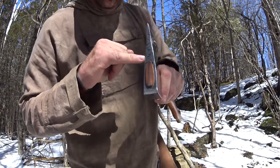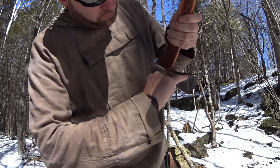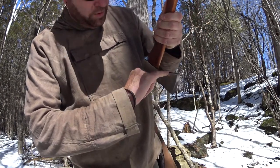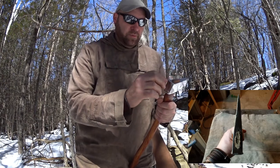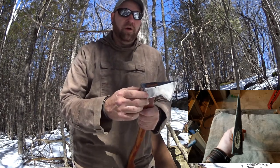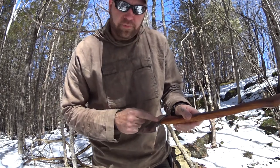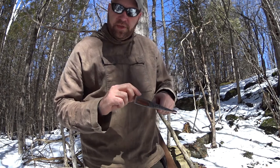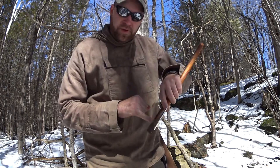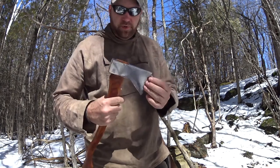You can see the old hammer marks or forging marks on it — they're on the bottom too, which makes me think those are forged hammer marks. The poll was mushroomed quite a bit when I got it. As soon as I see a mushroomed poll that's been beat on by steel, one of the first things I check is for cracks that run up the sides and on the weakest corners of the head. This one was in really good shape — it's very strong.